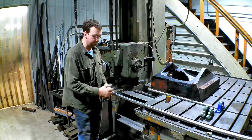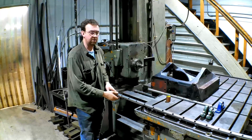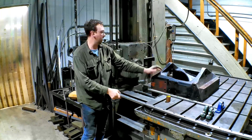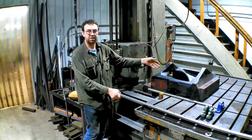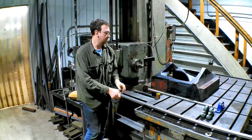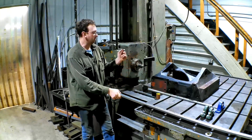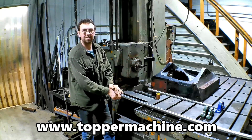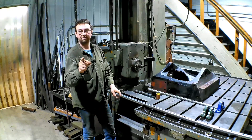A little bit of drilling, broaching, and drill and tap work, and we've got a nice shiny new inch and a quarter line boring bar. Now I can get this job going. This is the front end of a Case tractor — we're going to be boring out where this little bushing goes, bore it oversized, and make bushings that will fit in there. Since the bore is so small, we won't be welding it up — it just doesn't pay. So we'll bore, bush, and put the bushings in, and the customer can get his tractor back together. Just get out in your shop and get it done right the first time.